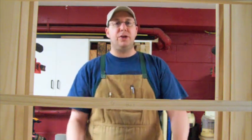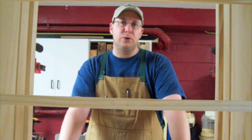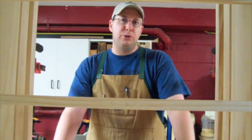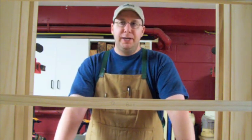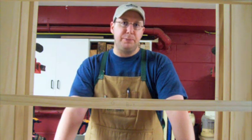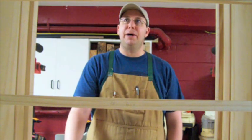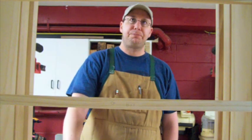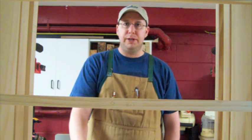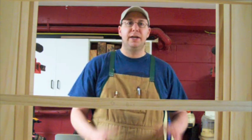This unit started out as five drawers with graduated sizing climbing up, but by the time I got to the top row — which would be broken into two side-by-side drawers — the space between drawer blades was only about four and a half inches, not leaving a very deep drawer. So I eliminated that fifth row, dropped it to four. The spacing came out much better: roughly seven and a half, eight and a half, nine and a half, and ten and a half inches on the very bottom. I used George Walker's graduated drawer technique from Popular Woodworking and it worked out great.